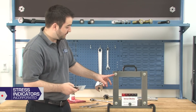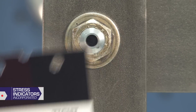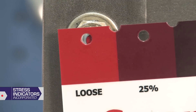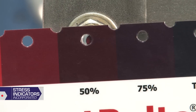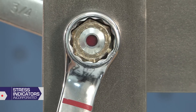It's important to compare the color of the indicator with that of the Verification Guide. The viewing windows on the Verification Guide make it easy to compare and match. We recommend tightening in stages and matching the developed tension with the guide. This will help prevent overshoot. This step method also works well when using sockets that can obscure the view of the indicator during tightening.